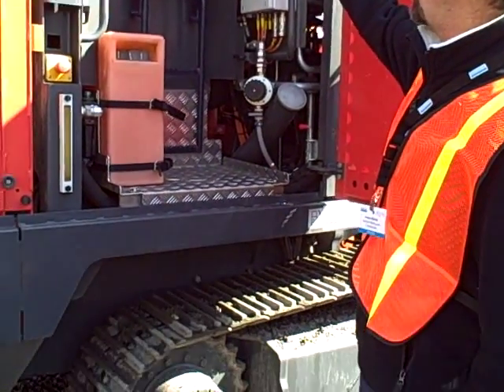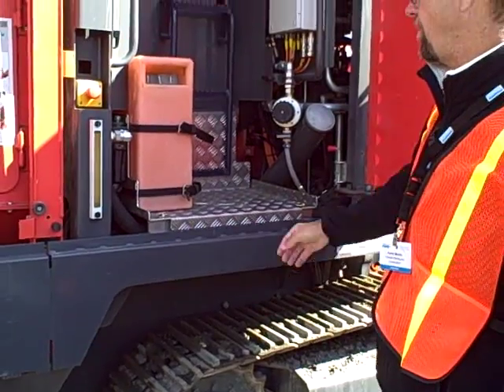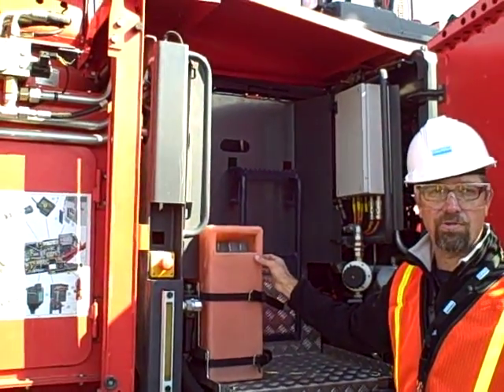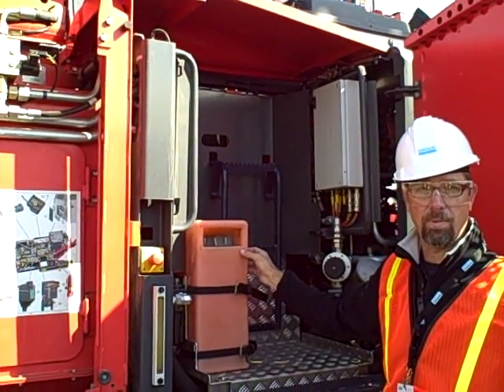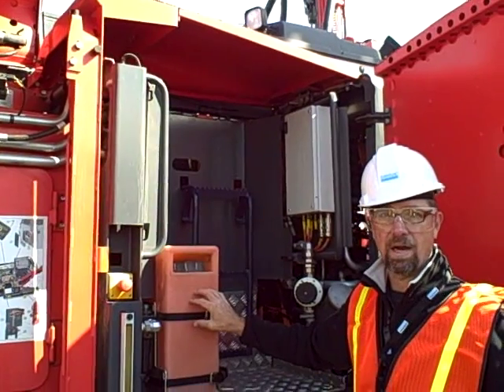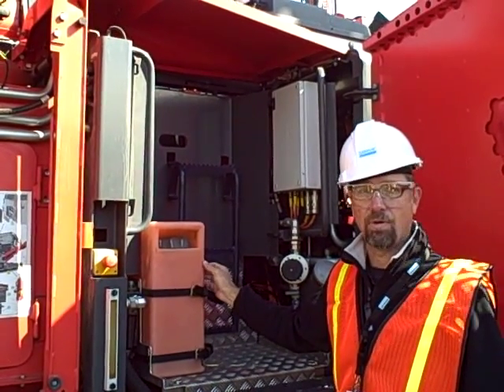It's now on the inside of the machine rather than the rear, which helps with balance. There's a ladder here that you can use to access your water tank, which as mentioned is in the center of the machine. You have your rock oil return tank here, which catches the used oil that goes through the drifter for lubrication purposes and prevents it from hitting the ground — an environmentally responsible way to collect used oil.